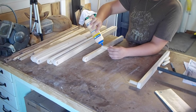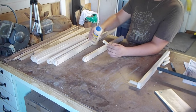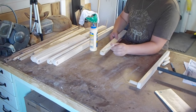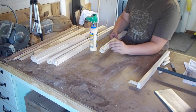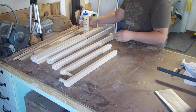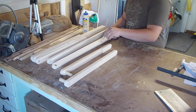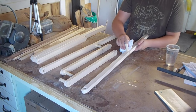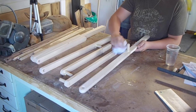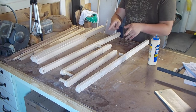Two shorter pieces and two longer pieces make up one side of the table. On each side, two of the shorter pieces get glue in one joint, and two of the longer pieces get dowel and glue in one joint. The longer ones will receive the glue and the dowel in the one that is 14 and a half inches from the bottom. It'll also be a lot easier to clean up any glue squeeze out now just with a damp cloth than it will be once it's dry. Now I'll let this sit and dry — this will make up one of the sides.